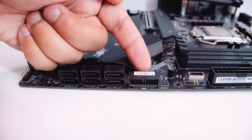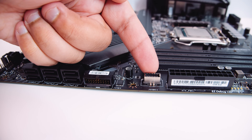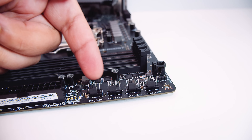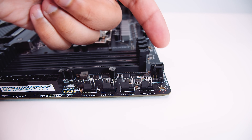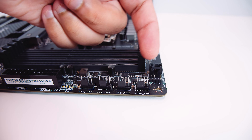There's a right-angle USB 3.2 header, a USB Type-C header further up, and a 24-pin power connector. There are also four more additional PWM fan connectors, another Corsair RGB header, and another 3-pin 5-volt addressable RGB connector below that.